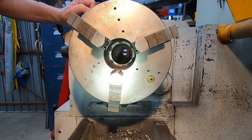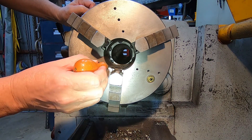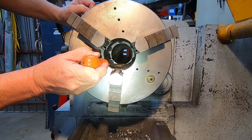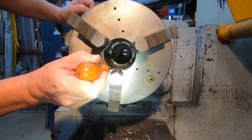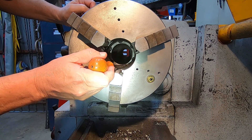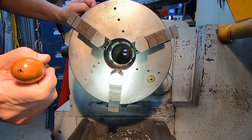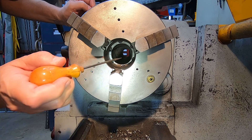So I'm going to need to do some sort of a backstop setup in the lathe. Let's go and have a look at what I've come up with. To make some sort of a backstop I had a close look at the situation in here. I've got a rather large bore all the way back there — that's the front end of the spindle nose which is a smaller diameter than the chuck. So I can make something which is a good fit inside the chuck bore and it would fetch up against the front of the spindle nose. That gives me a register to work with. I'll make basically a big slug to fit in there, register against there and have some ability to space things off forwards.